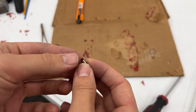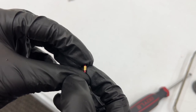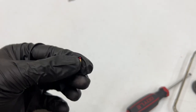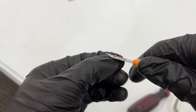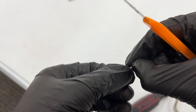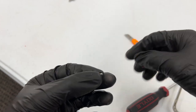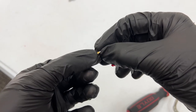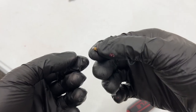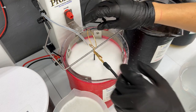We're going to start off by plating this little stopper piece first in our 24 karat gold. It just came out and it's looking pretty good — it's small and hard to film but it turned out well. Now I have to get a razor blade and remove the masking by sliding it up on the edges to peel it off. The masking did a pretty good job — it worked well and didn't come off in the electro clean, which we've had problems with before. Now I'm going to plate this knife blade in gold, putting it into the electro clean to get it going.